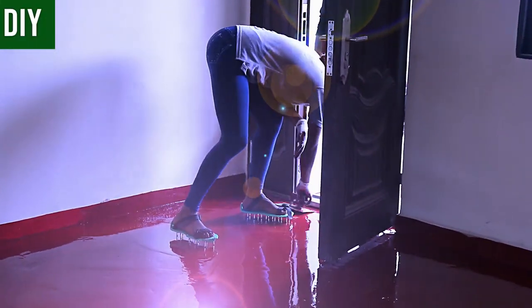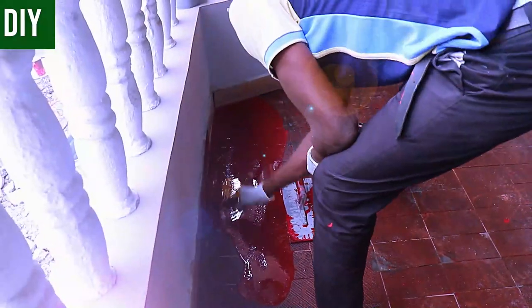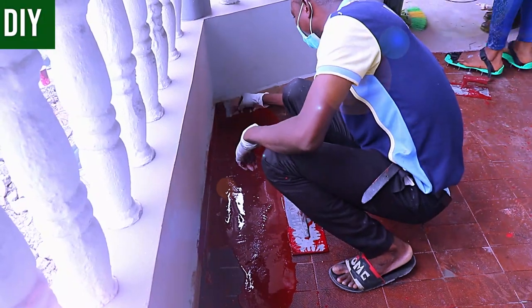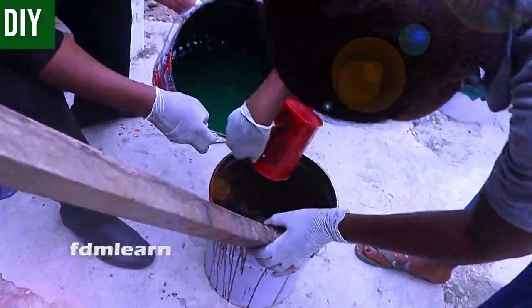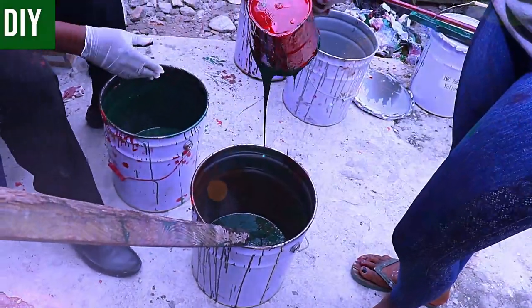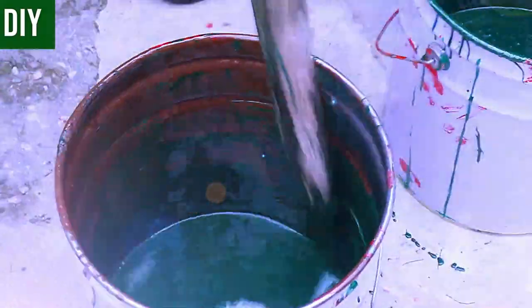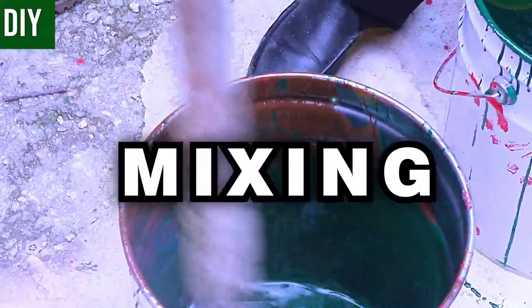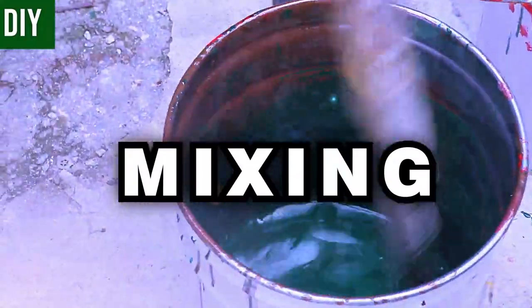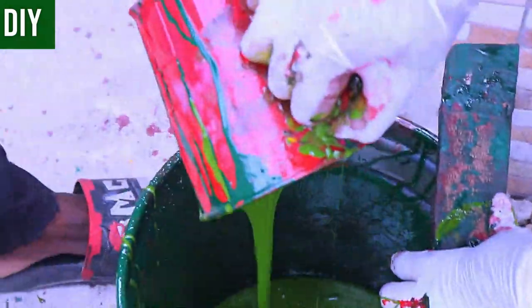Things can go wrong really fast if you're careless with mix ratios or fail to mix thoroughly. Sometimes you see epoxy installations that refuse to dry and remain tacky and soft — like properly chewed chewing gum — days after installation. That's a problem many epoxy installers face. Epoxy typically hardens between 8 to 24 hours after being poured, usually at the 12-hour mark. If after this curing period the epoxy is still tacky, the problem is most likely improper mix ratios, insufficient mixing, or a combination of both.